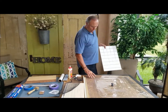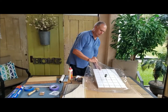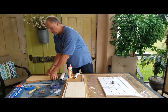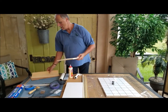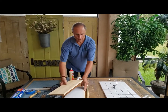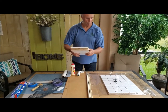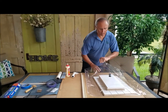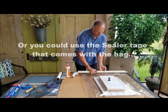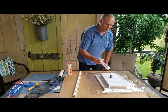I made this plenum board, which I would put in the bottom of the bag like this. Then I'm going to take my two veneers, glue these up on both sides, tape the bundle tight, and put it between these two caul boards. Then I'll put the whole thing in the vacuum bag and seal it with these pieces of PVC pipe — snap them together, and that will make a tight seal.